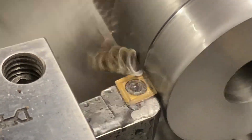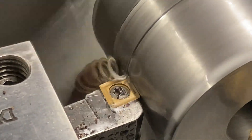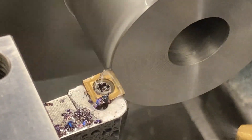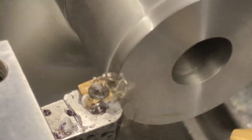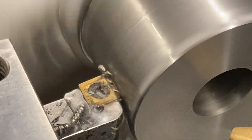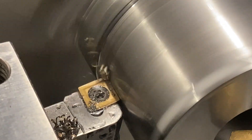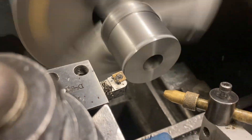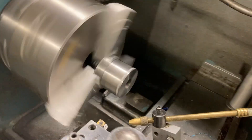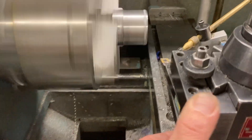Getting my fingers out of the way. Those chips are purple — as you can see when they come right off the tool they don't change color, but as they move further away from the coolant, those babies are conducting some heat for sure. All right, that's the rough face and turn done. Turning the coolant off so I don't get sprayed — we're going to change tools.